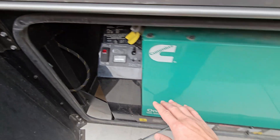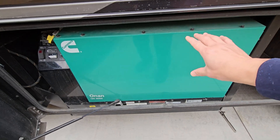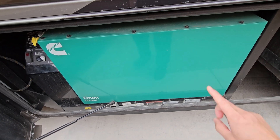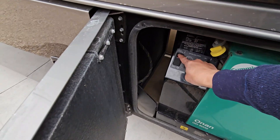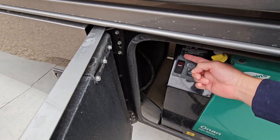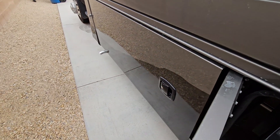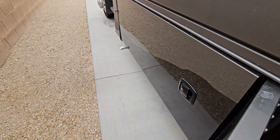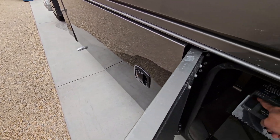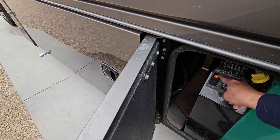This generator specifically has three cylinders and three glow plugs. Same thing for the 6,000 watt. The 3,200 watt I believe is only a single cylinder, so one glow plug. When you hold the up button in, there's an actual timer, and the colder the weather or the colder the temperature sensor reads, that glow plug will activate longer. Typically if it's warm it'll fire right up, but when it's cold those glow plugs will work a little bit longer.